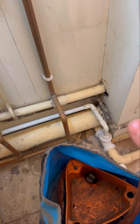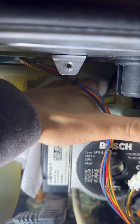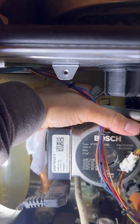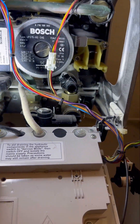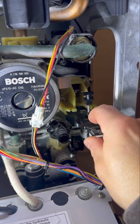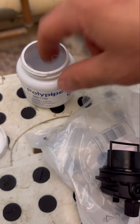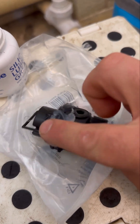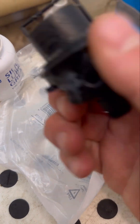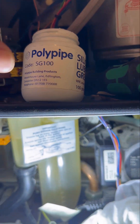Look at the state of that — in the bin. Then you're going to get some wet wipes or similar and clean that hole out. At this point I take the hose off, shut the drain off to get that out of the way, and pop the diverter valve motor back in. Then you're going to get plenty of lube — you have to put the o-ring on yourself, but get that all lubed up. Plenty of lube on just makes your life easier, and then put plenty of lube in that hole as well.